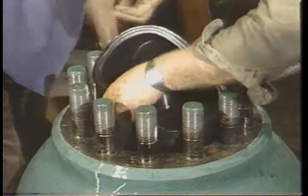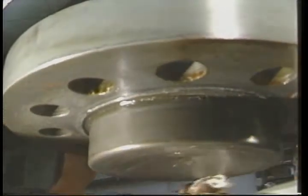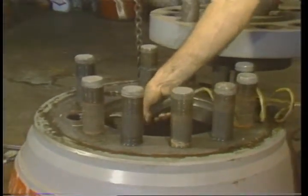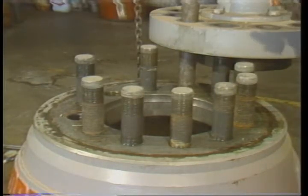After removing the diaphragm, you'll need to clean and inspect the unit. Thoroughly clean every surface inside the dampener. Use a hose and clean all the loose mud and dirt from inside the body, the shoulder where the diaphragm seats, and around the fluid port. Also, clean surfaces on the head that come in contact with the body and diaphragm. Use a wire brush and scour the same surfaces. Make sure the shoulder seat is clean so the diaphragm will seat properly, but don't remove any metal while using the wire brush.